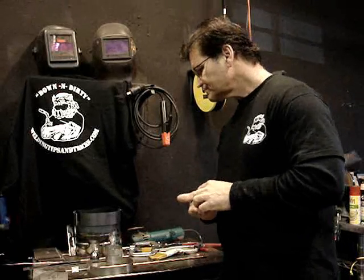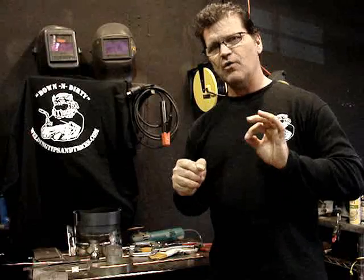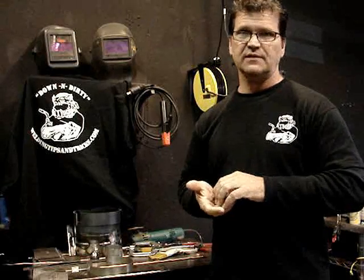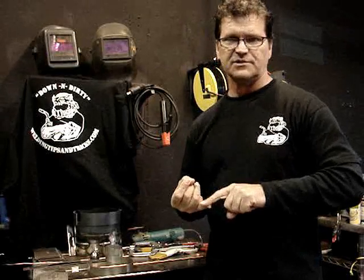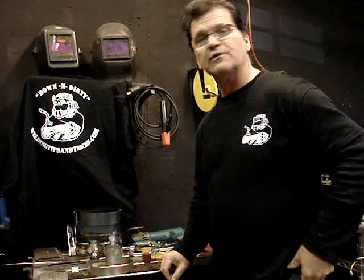There are some welding techniques that you can almost extrapolate across the board for all stainless steels. Stainless steels are not very thermally conductive, which means heat builds up. That's why it's a little harder to weld — because if you don't get in and get out, if you don't get moving, things start to heat up, they start to expand and distort, they start to oxidize, they start to look bad. Things go south on you quick with stainless steel.